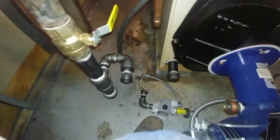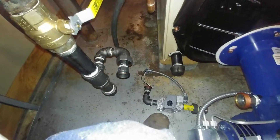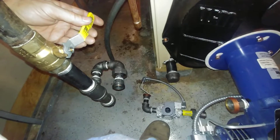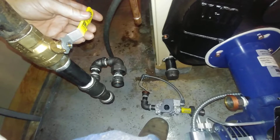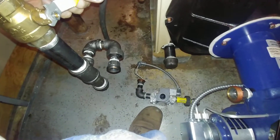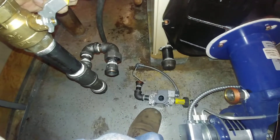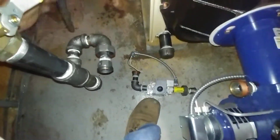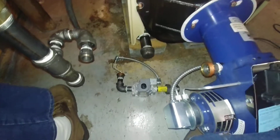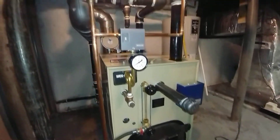This pipe is full of air, so I'm going to do something you shouldn't do at home — we're going to quickly purge it of air. When I open up this valve you'll hear the air rushing out, and then as the methane, which is lighter than air, comes through you should hear a drop in pitch. And there we go — smell those mercaptans. The gas line is purged and installed. The only thing left to do now is wire and fire.